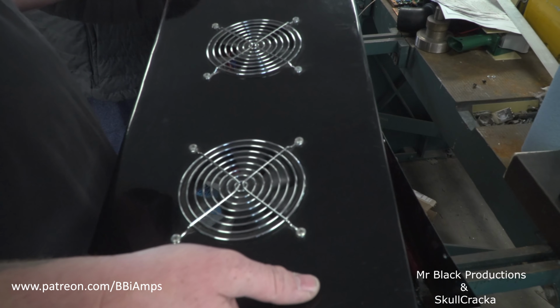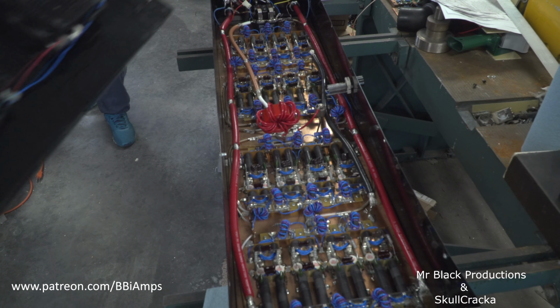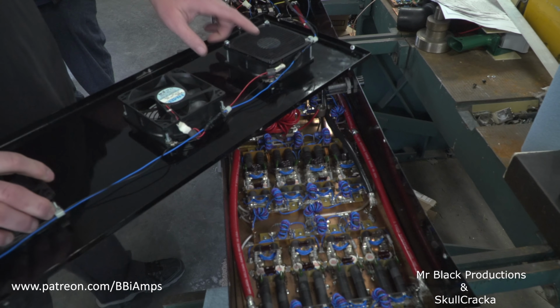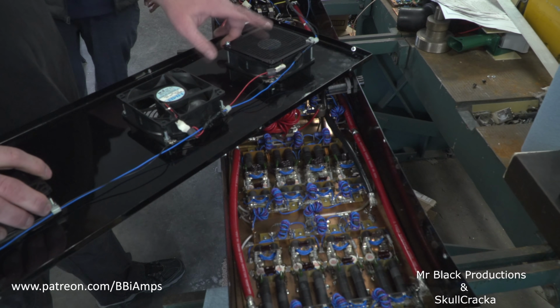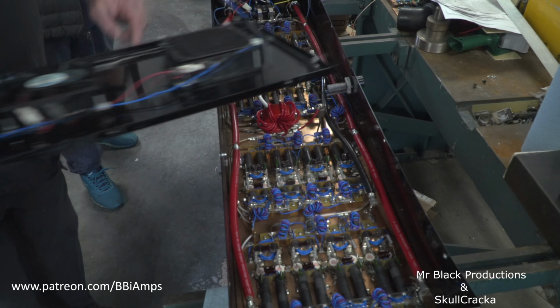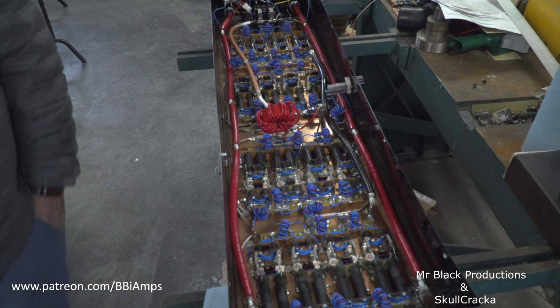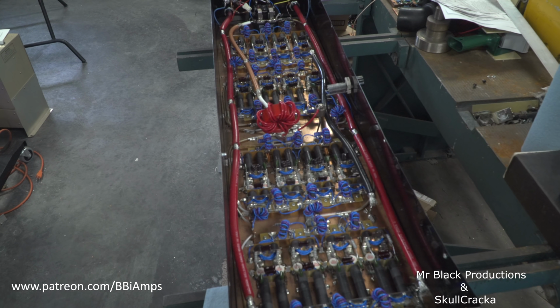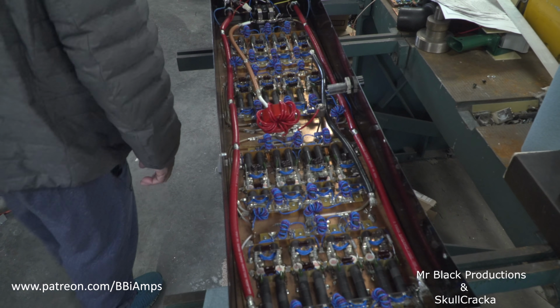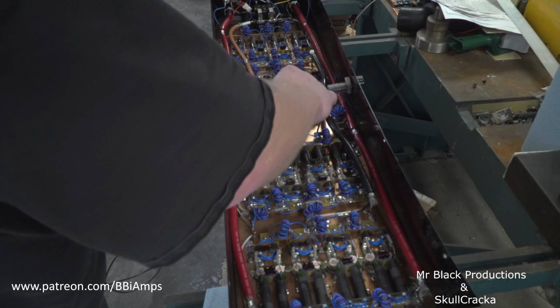Oh, man. This is a ghetto hood rat tactic right here. I'm here to tell you. Look at this, I put the screen on the inside. Why? Because the RF at the relay was screwing up the fan, I bet you anything. Well, you might want to pick a mesh. If you notice, it's been replaced a couple times. Wait a minute. You might want to pick a mesh that wasn't metallic. What a dumbass. Because that is not going to do anything. It's going to run right through it.